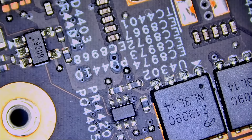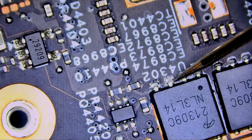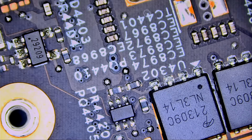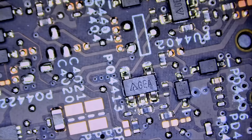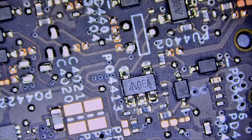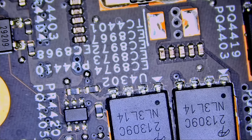The diode mode beeped — let me measure in diode mode again. It beeped before and it's beeping now; we are reading 0.016 and not 0.005. I'm not sure if we can inject voltage on a 23-ohm line and still see what's getting hot on the board. Usually you can inject voltage and force voltage on a shorted line — we're going to force maybe 1.5 volts through that line and inspect under a thermal camera to see if anything gets hot.